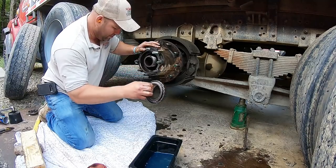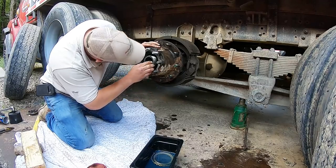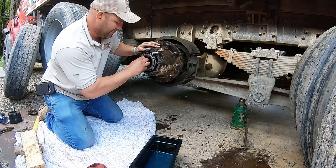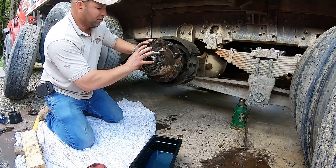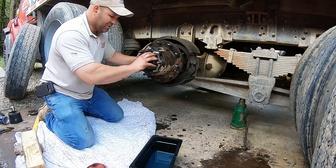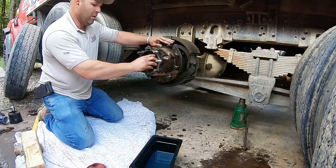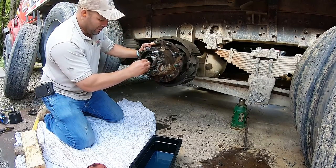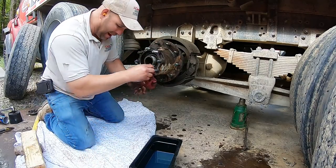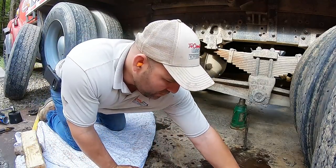That bearing in there. Hang on, got a piece of wood. Make sure she's all clean, center that up. Put that bearing in there and that will true this hub up so you could get your seal on better. As soon as I slid that in, it went whoop, and it centers it perfectly in here. Now, she's a good of good. Once you draw this in, you're gonna bind it tight and then back it back off, and it will set the bearing.